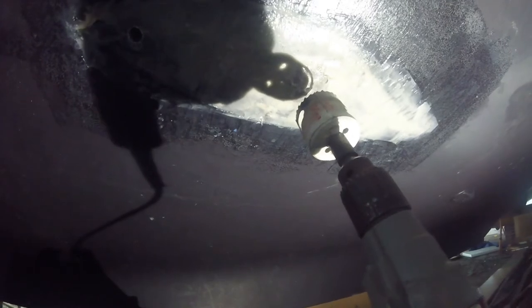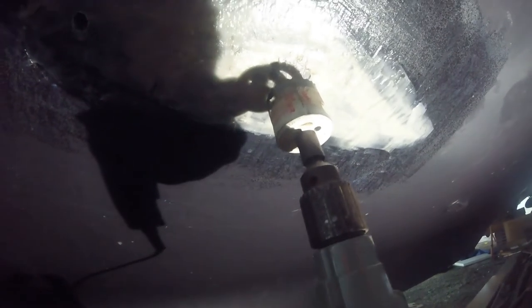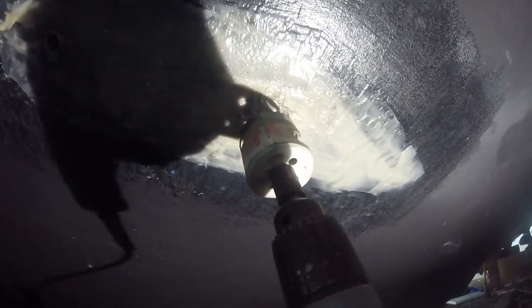However, this big transducer has a cable gland. It doesn't have a through hole stem. So we don't have to worry about a much more difficult cut of going at this straight angle. And most boatyards won't know that. They're conditioned and programmed, unless they read the manual on this specific transducer, to make them go straight. And then you would need another fairing block for the cable gland. And that's just not necessary in this configuration. So we're going to keep our drill at the same angle as the hole, and we're drilling our cable gland hole.